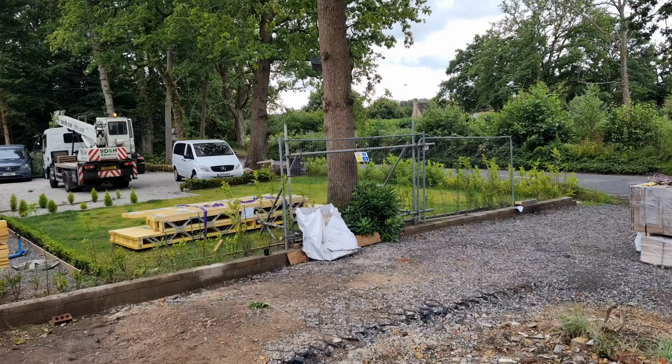The first truss is coming up. It's going to land down between the scaffold and the end of these joists. Callum's busy over there. We've screwed these joists in so that holds everything. And then we'll land this first truss, which ends in line with that wall plate junction there. Brace it up, get it nice and true, and then we'll work on the other side of that scaffold for the next trusses.